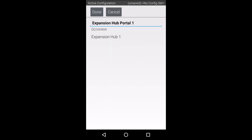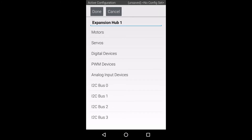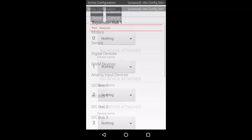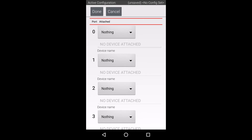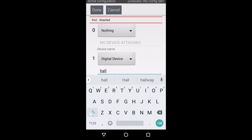On this screen, select the expansion hub. If you don't see the expansion hub on this screen, be sure your robot controller is on and connected to a powered expansion hub. Select the expansion hub one more time. On this screen, we need to select the digital port that our sensor is plugged into. The digital ports on the expansion hub are grouped in sets of two: ports 01, 23, 45, and 67. The Rev Hall Sensor is wired to the second port, or the N plus 1 port, where N is the first of the two numbers in each group. My sensor is plugged into port 01, so we will need to select port 1 on this screen.